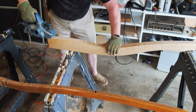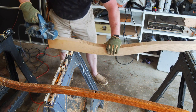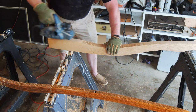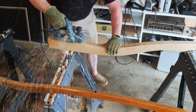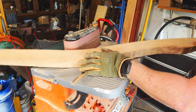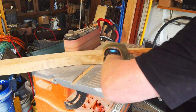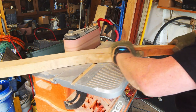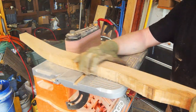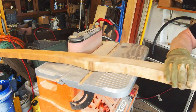While the width at the back is pretty well set to the rudder bracket, I'm going to trim the top and the bottom a little bit. Pretty much after every couple of passes, I take it back outside and fit it into the rudder to make sure it's fitting well — the reason I'm not showing that is because it was pouring down rain outside and I didn't want to get my camera wet. Next, I start getting it down to a finished shape using an oscillating belt sander. These oscillating belt and drum sanders are really indispensable tools for woodworking, able to give you a lot more shape and control than just about anything I've ever found, especially for pieces like this with compound and complex shapes — all these curves along with a taper.